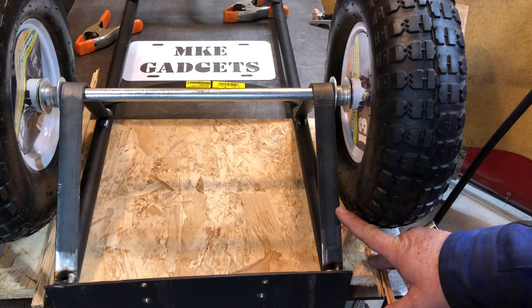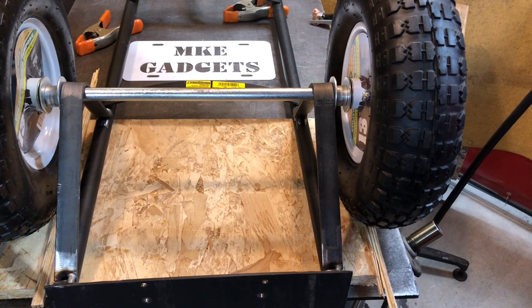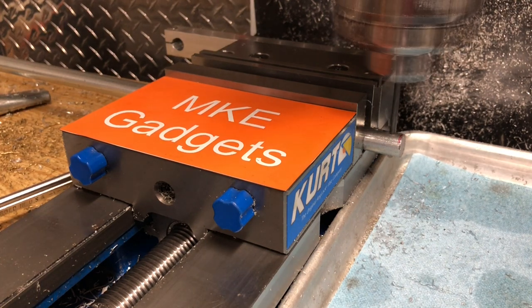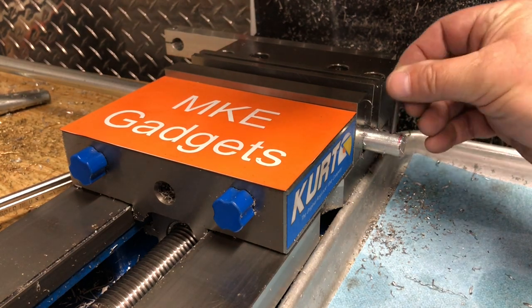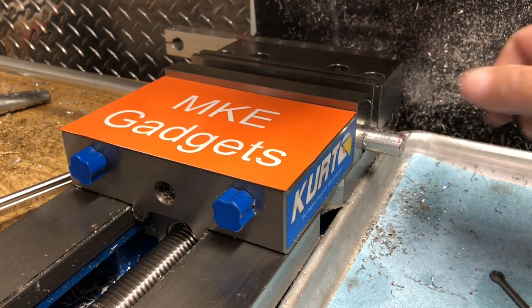With the two brackets tacked on pretty good, now we have to turn our attention to the axle. The axle's gonna be welded on, but first I've got to drill some holes for cotter pins on the end. Let's go over to the Bridgeport Mill and drill a couple of holes. I'm gonna drill 11/64 inch, 5/16 of an inch from the end — but first I'm gonna center drill. Let's check our cotter pin — perfect. Now on the bottom I kicked up a little burr, so I'll take that to the belt grinder and clean that up.